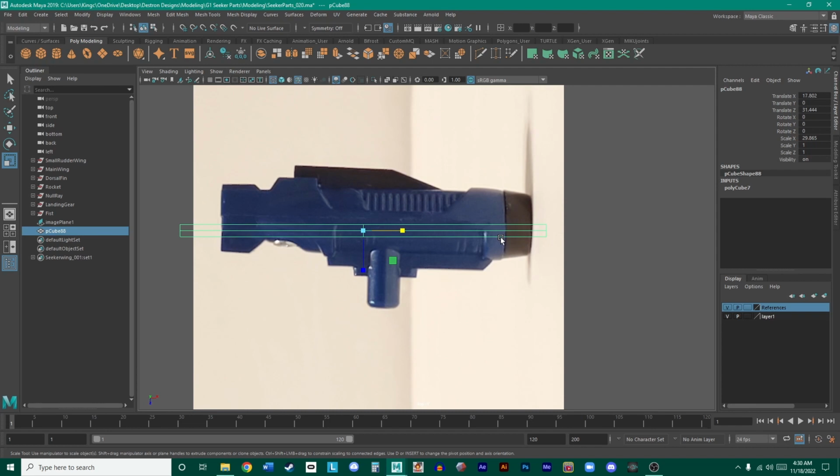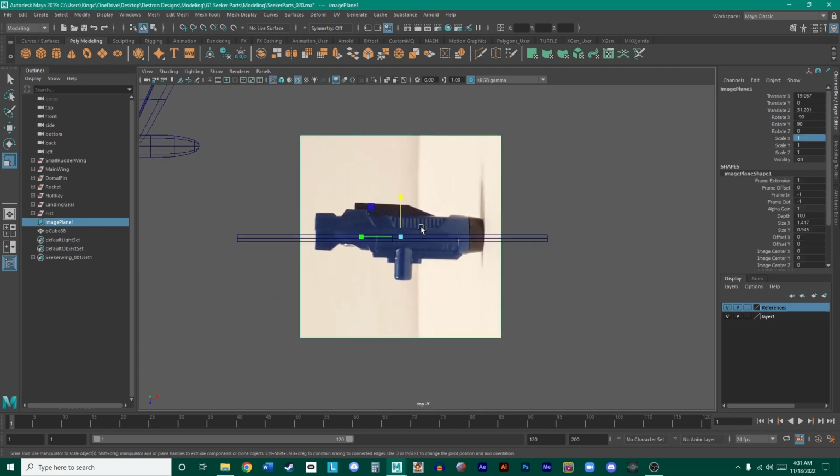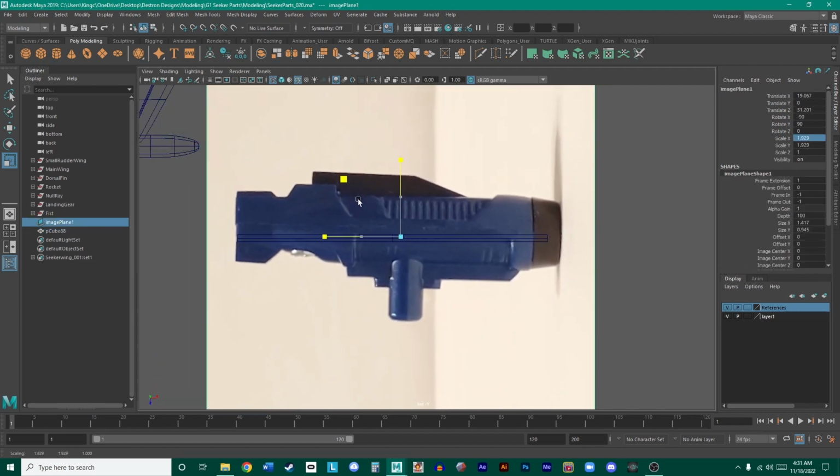Yep, okay, calipers are looking good. Sometimes they're not calibrated, and then you have to re-zero them. That's okay. Alright, so according to this reading, it's 46.65 millimeters long. So let's set the length. 46.65. And then we're going to scale our image to meet that length.